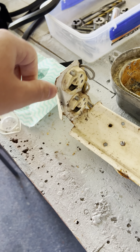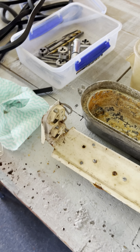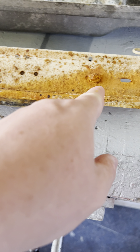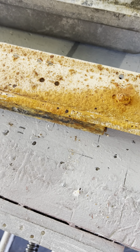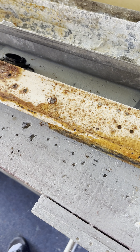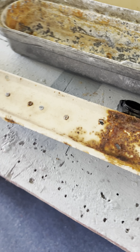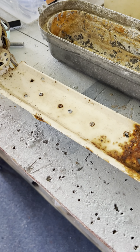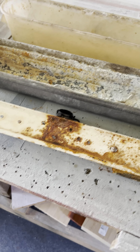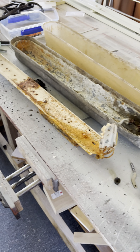I'll replace the lamp holders with HPM 382s — I'm out of them right now and I'll have to get more. Those lamp holders are actually made by Peerlight, but HPM makes aftermarket versions which are the exact same footprint. Getting that ballast off might be a challenge because the screw is so badly rusted. On the other Zodiacs these holes are big enough to accommodate an M5 nut and bolt, so I used M5 stainless steel nuts and bolts. It would have been nice if they'd used stainless steel parts originally — these were zinc plated and zinc plated stuff just rusts.